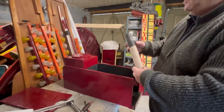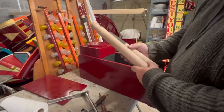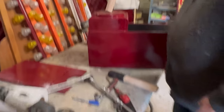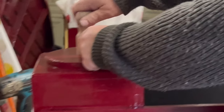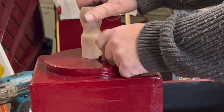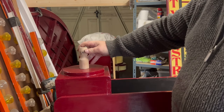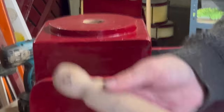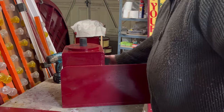Here's one I made earlier — a pin with a little black end. We get the rolling pin — it comes with a knob on each end, you cut one end off. Then pop it in there, push it right down, and turn it. Get a pencil and mark it. What we do is cut it just a little way below the arm — so that when it goes down it goes just below. If you leave it too long it'll bend the arm because it won't go down far enough. So you need to end up with a piece just going below — see that? That's it.